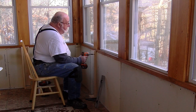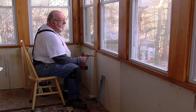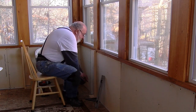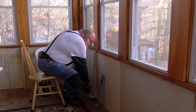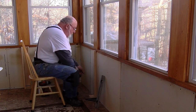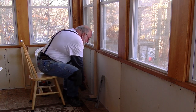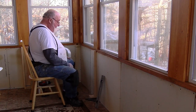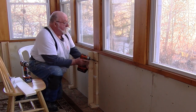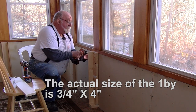Once I have it square I'm going to take a couple of three-inch screws. The reason I went with three-and-a-half-inch screws on the top is because the two-by-four is an inch and a half and the drywall is a half an inch, so that gives you two inches — I wanted three-and-a-half to make sure I had a good amount of screw into the wood. Whereas on the floor I'm drilling directly into the subfloor, so I don't have to worry about getting through drywall. That gets that in place. Next we'll install these pieces of one-by using one-and-five-eighths-inch screws, just screwing them right to the sides of the two-by-fours.